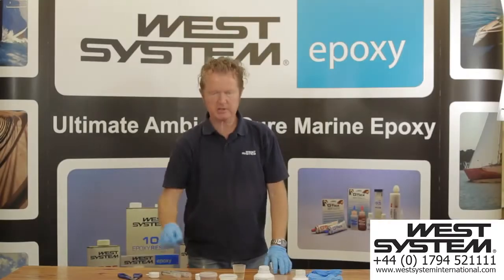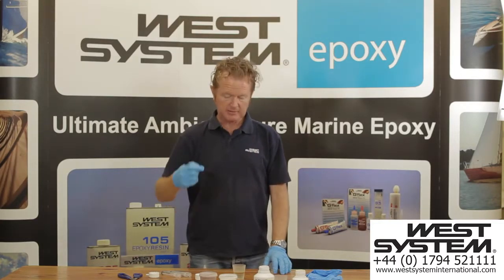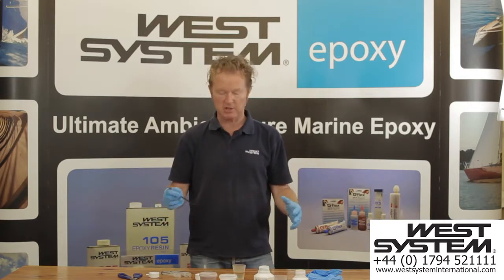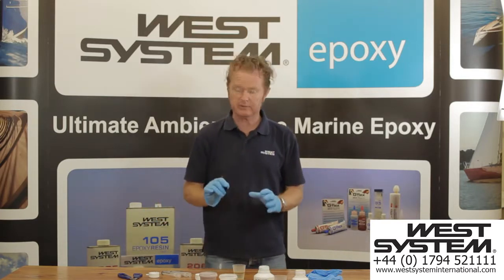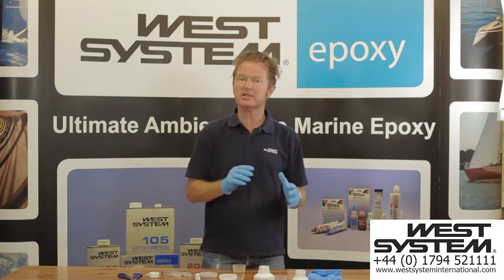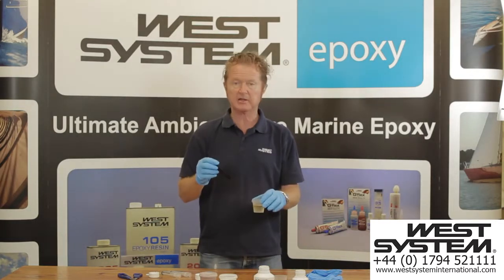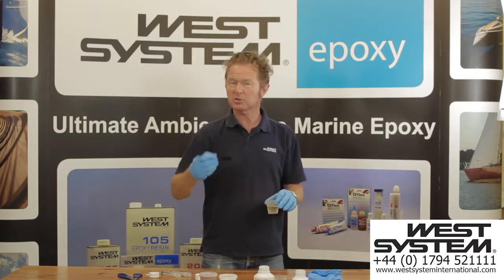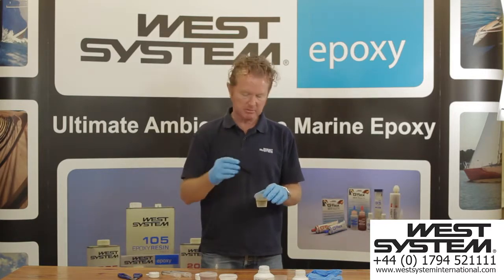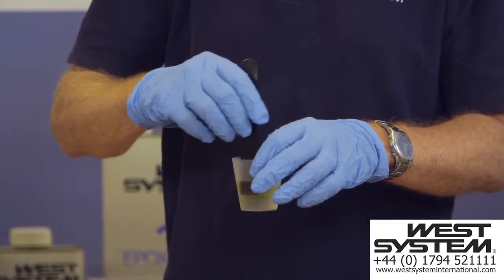It's important to mix the resin and hardener thoroughly. It's very important to get a completely homogeneous mix of the two materials. They look very different together. The hardener has a slight amber colour and the resin has exceptional clarity. It's important that you mix these together, because without that you cannot guarantee that West System will cure. It must be mixed thoroughly. We suggest that you mix for 3 minutes.